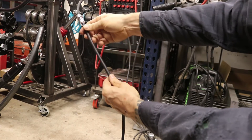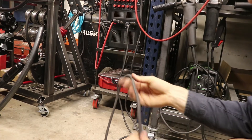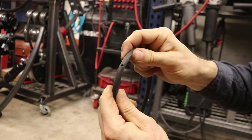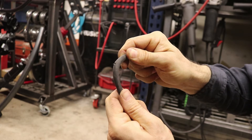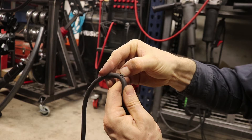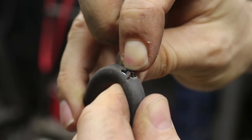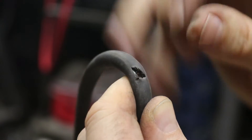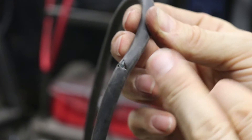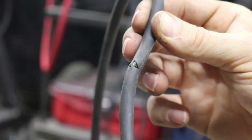Now I go ahead and start working my fingers down through this line and looking for stuff. I've found a little cut in my line. And I'm willing to bet if we open this thing up — I can see a little copper piece in there of a cut wire. I bet it's going to be that black wire, and if we go in there and piece that back together we'll have a working welder again.